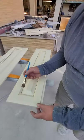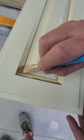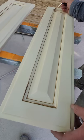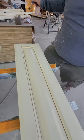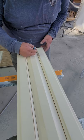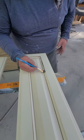Same thing - I'm not worrying about being all precise. The main thing is to get it inside the groove; to me that's the most important part. Even if it gets on the other molding, I'm not worried about it - you've got a second to work with it. You do have to hustle a little bit because it will set up on you pretty quickly.